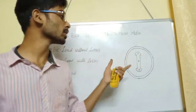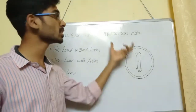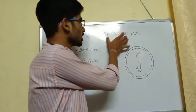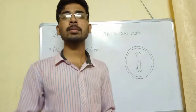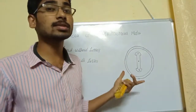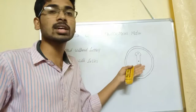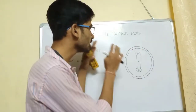The motor does not behave simply as a load. In no-load condition there are losses in motor behavior. The Synchronous Motor is compared to a basic DC Motor. The DC Motor is known as a single-excitation — nothing but DC supplies. But here we have a double-excitation Synchronous Motor: the stator has a three-phase supply and the rotor has a DC supply. This is double-excitation. We first analyze the DC Motor and then the Synchronous Motor.